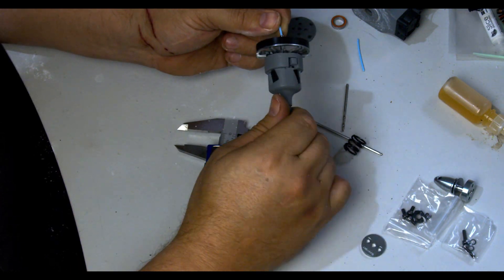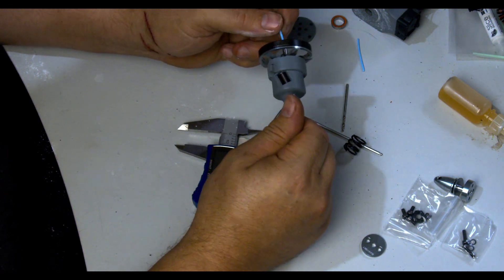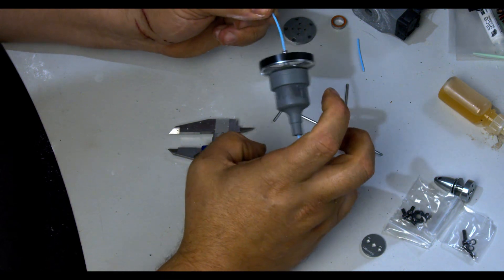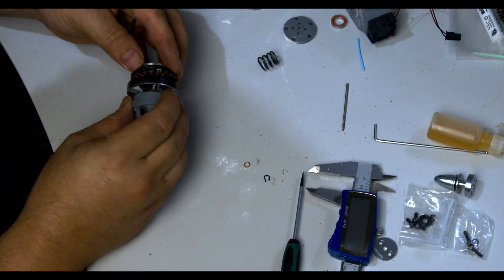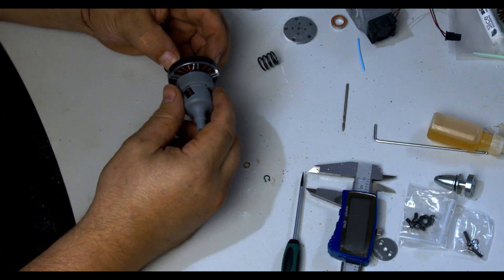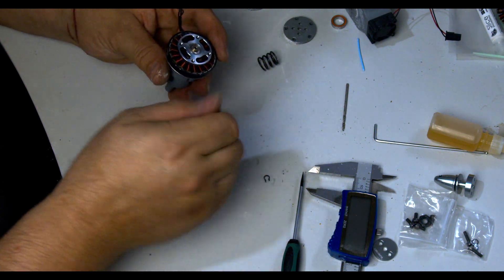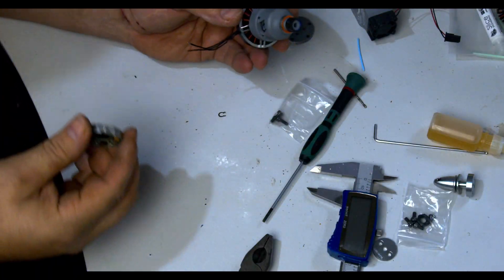It just shifts up and down the filament with such ease. It's really important that this works like this, because if it doesn't, it will snap the filament instantly when you fast retract. You can spin it quite fast and it just progresses up and down the filament. And now we have our extruder. So now we put back on our little spacer — probably should have cleaned the dust off because that will get into the motor.